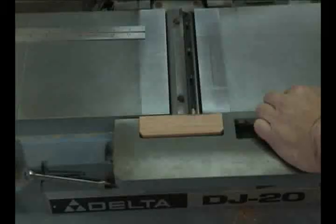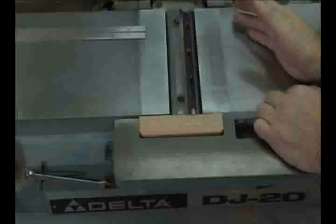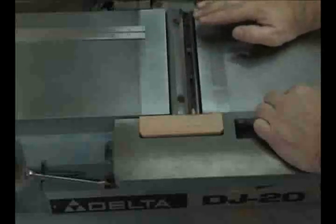Okay, so now the next question is, well, where do we want the knife to be in its rotation to get the lowest possible secondary bevel? If you want the three knives absolutely identical in height, you would keep rubbing until it refuses to cut anymore.